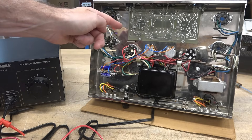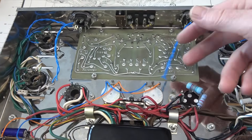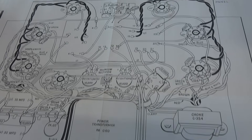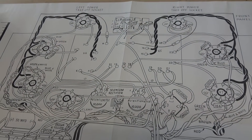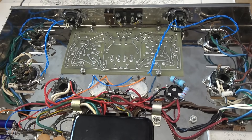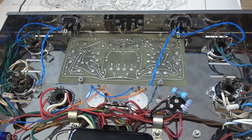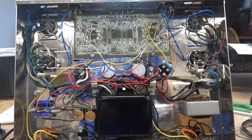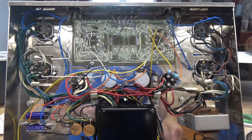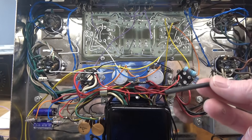Next I'm going to wire up the circuit board. I've wrapped up all the tube socket wiring and I'm adding pigtails to each of these sockets that will go to the circuit board per the diagram. You could actually build this whole amp from these pictorials — they are that detailed. I'll get all the pigtails landed and ready to go into their locations on the board. I believe all the pigtails are connected. Over here you can see some 10-ohm resistors with exposed leads that I'll be putting heat shrink over.